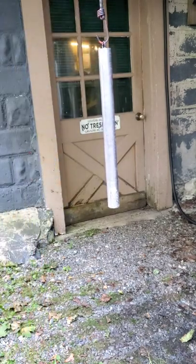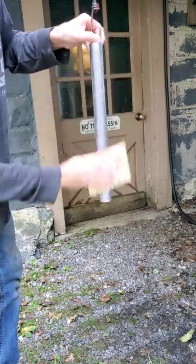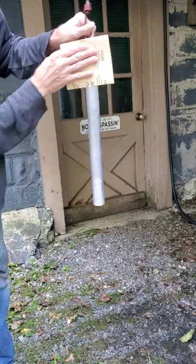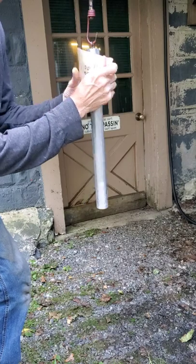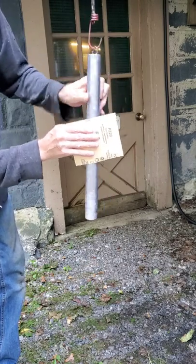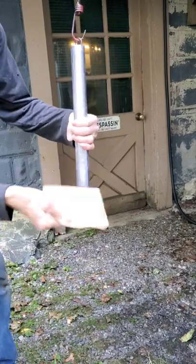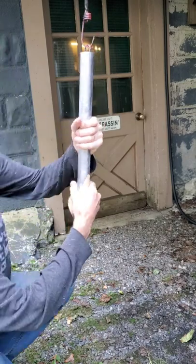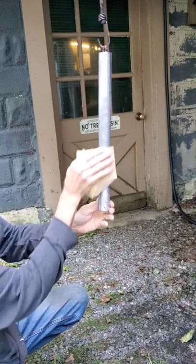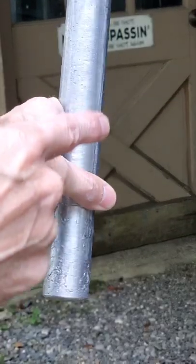First things first, I'm going to give this a quick sanding. I'll take some 220 grit sandpaper — we don't want it perfectly smooth. We want it scratched up so the spray coating has something to grip and bite onto. You don't want to use a really coarse paper or it'll just look rough. You can see it's got it all scratched up — that's what we want.